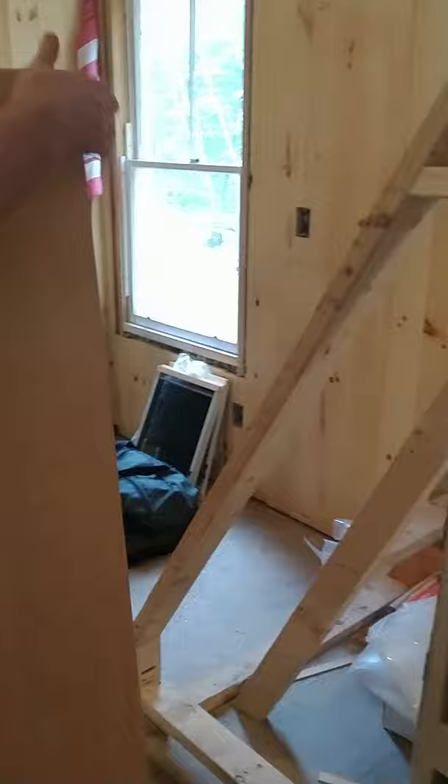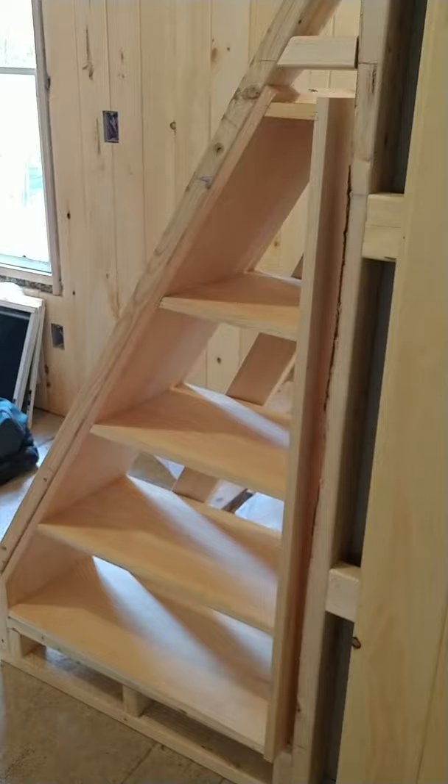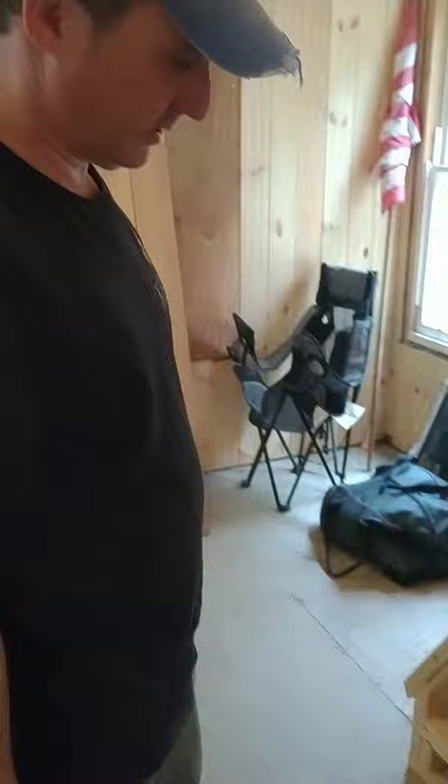We're going to take this all back apart, glue it back together, and do a dry fit in place. We've got this all together, glue is setting — do a dry fit in here — there's the idea. A great little stair cabinet. We've got to put tongue and groove pine in the back for the backer, then sand it and put a pre-finish on it, and then do the final installation once that's all done. But there you have it — great applications for Flexus. Thanks for watching.